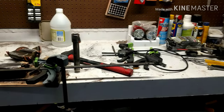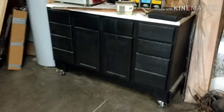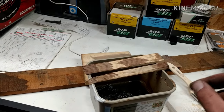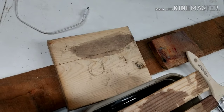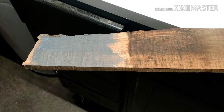On the flip side, I said I'd keep you informed - here's the back side of one of the doors, and here's the other side. This is just pallet wood, cleaned up. We've got vinegar and steel wool sitting in a bucket, and these are the colors I'm getting from it - just dunking the wood in the water to jostle the steel wool around. That's one light brushing on clean pine, and that's one light brushing on pallet wood that's been outside for a bit.